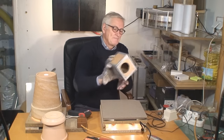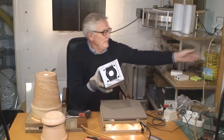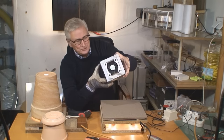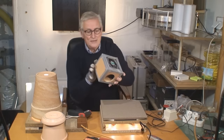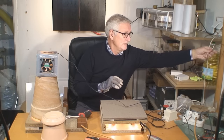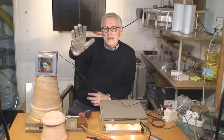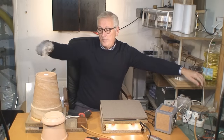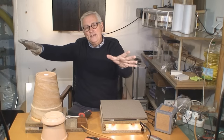The other thing I built was this little fan — it's a 12-volt fan. I'll just disconnect it here. This is a fan I got off an old computer, and I built a very simple box, drilled a hole in the bottom. I drop it on the top and connect it up to my 12-volt feed on the wall, and that actually forces the warm air out into the room. The other addition I want to do is to run an aluminium water pipe around this and feed that heat off into the rest of the room.